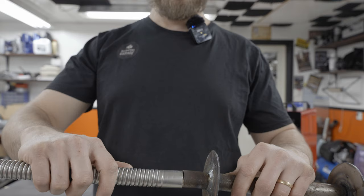Let's fire this thing up and see. Yeah. So we got 1 amp, 2 amps, 3 amps, 4 amps, 5 amps, and then it cuts it off. And it's supposed to do 8.5. Maybe there's something with this type of, maybe you can't use this type of driver. Maybe you need something else. Maybe I'm just not good enough at electronics to understand why. But yeah, it doesn't work. We're gonna need another type of transformer, unfortunately.